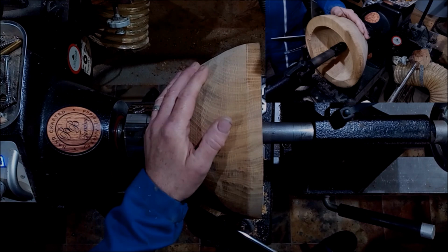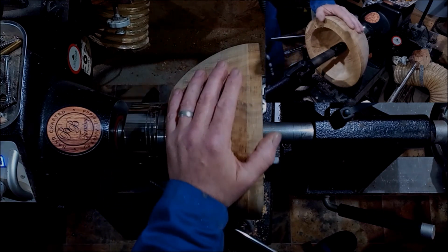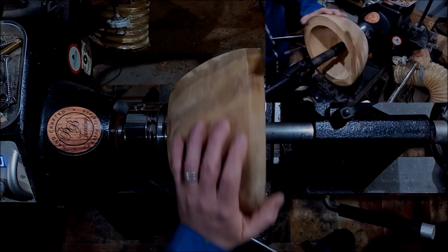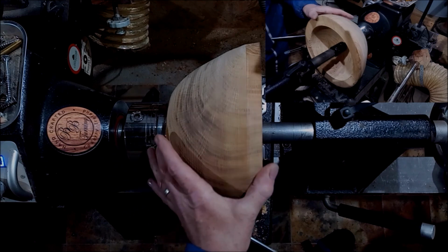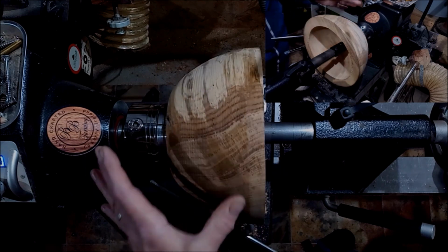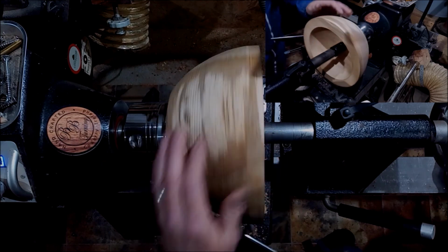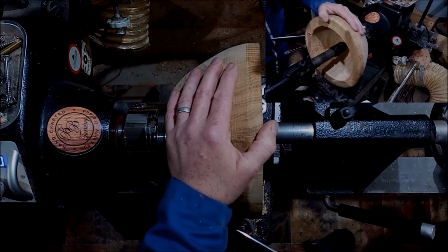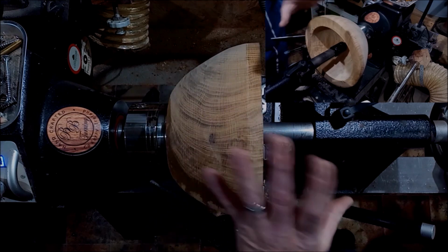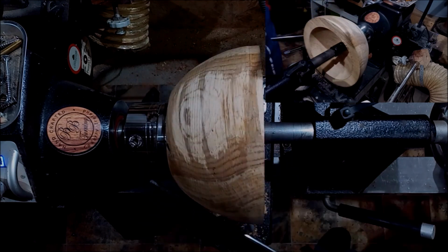It's actually a grind on a tool that sorts it out. In here I have a piece of white oak that I think is 11 across and 5.5 deep. This problem only really happens with deep bowls. So we'll get through the outside of it as quick as I can, do the Yorkshire Grit bit, which is another legend this week, and then we'll tackle the inside and I'll go through how to sort it out.